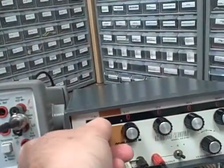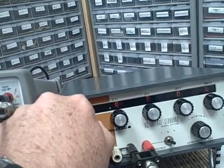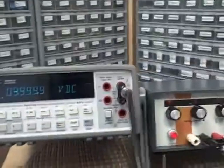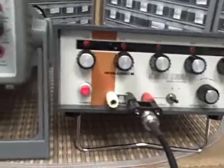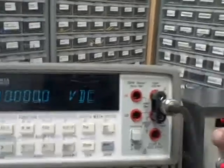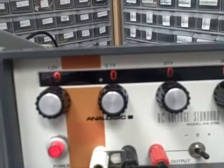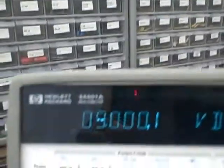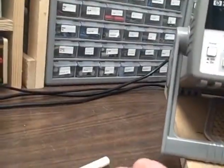Now let's go ahead and take ourselves back up to 9. Now let's go to 10. We are going to keep track — we are going to make a little cal sheet here. So we are set to 10 volts and we have 10 and 4 zeros. We're going to switch down to 9 volts. Now we have 9 and we are reading 9.0001. Let's mark that down.